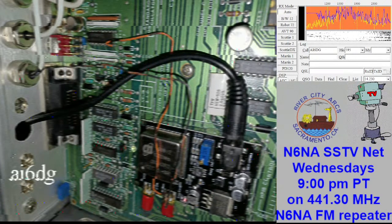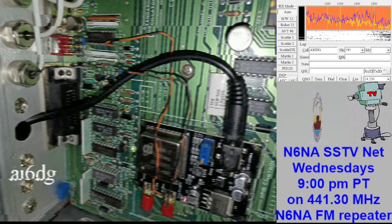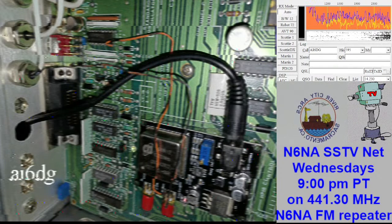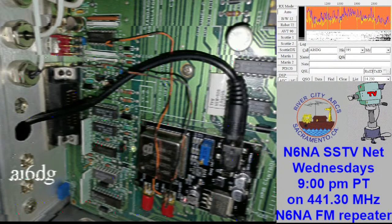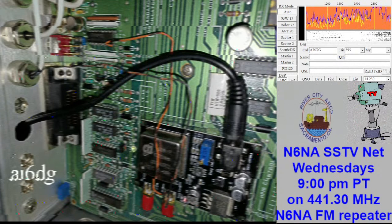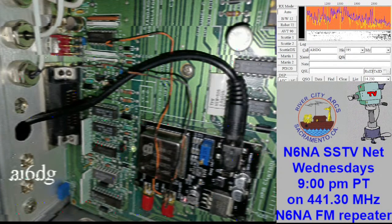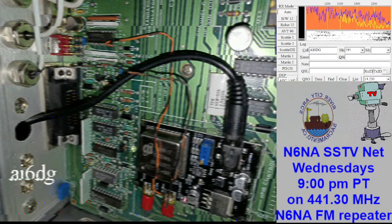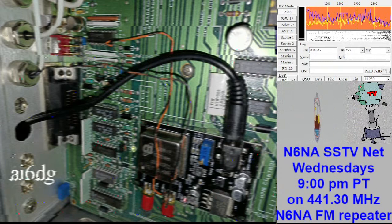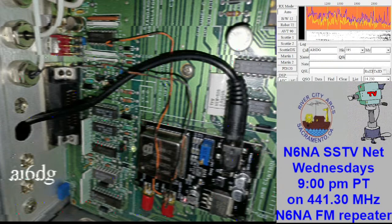The 7.5 volts. I got a couple of 7.5 volt wall power supplies, you know, the little bricks that you plug into an outlet. 7.5 volts because this will run from 7 up to 14 volts or so. But I tried it at 12 volts and it got really hot. And when I tried the 7.5 volt that this plug is feeding it, it's fairly warm. Definitely worth it.